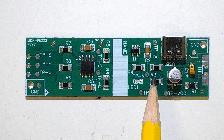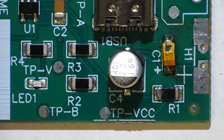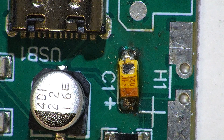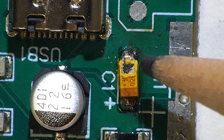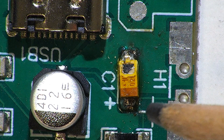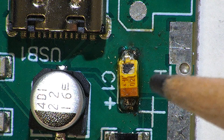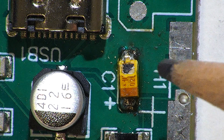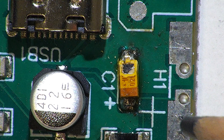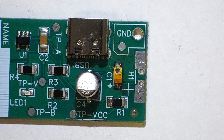I moved my way a little bit further back, and some of you may have already pointed this out — you may have noticed that something does not look correct over here. Something, in fact, looks like it has a giant hole coming into the top part of this capacitor. This filter capacitor, which is meant to prevent large amounts of electricity from going further down the circuit, has completely blown into a shorted state. This capacitor is missing several pieces on the inside, and it is burnt.